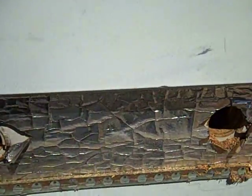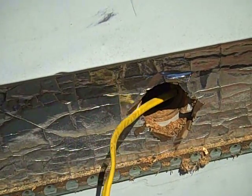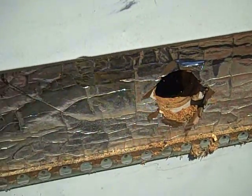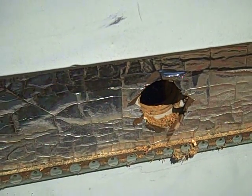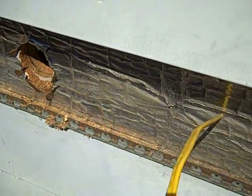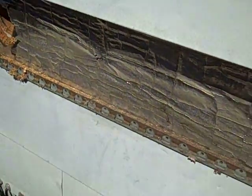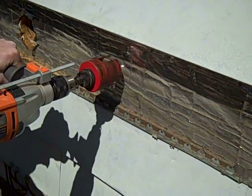In this case, even though we're watching our centers, this hole came out to be pretty close to a stud, and that's something you have to watch for. There's no guarantee that your studs are 16 or 24 inches on center. So with a stud being right there, our next cut is going to be about seven inches to the right of that stud, and hopefully we'll be back on track with 16 inches.